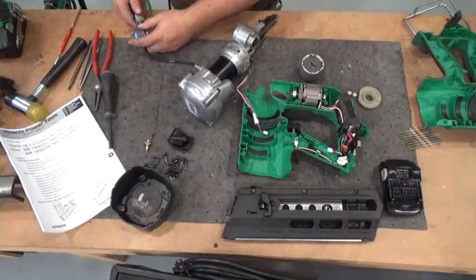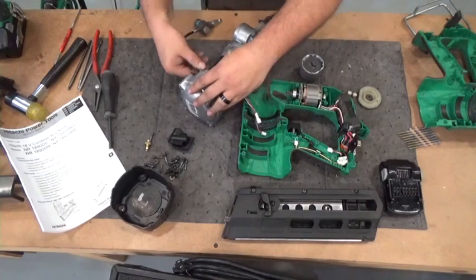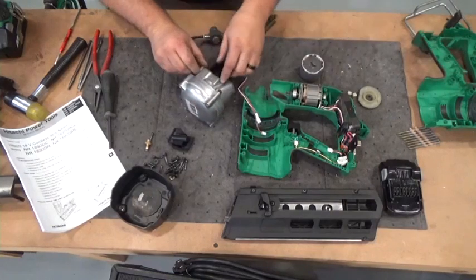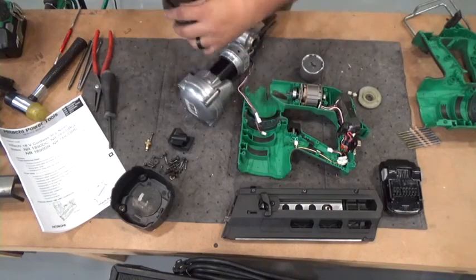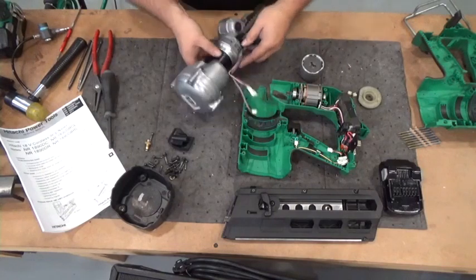We got that all done. It's equalized. Take the regulator back off. And all you should hear is a slight loss of air. A little, there it is, right there. All that is the air pressure that's inside the tube of the regulator, and that's all you want to hear come out. If you hear more than that, then you have to go ahead and plug it back in.